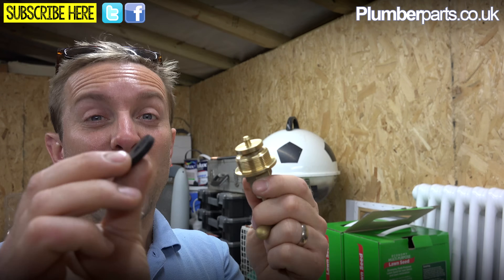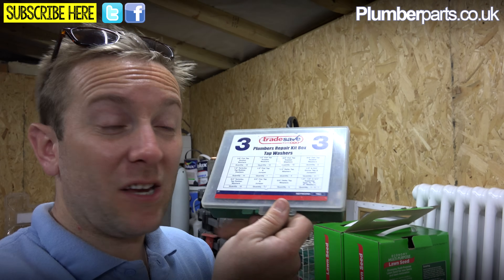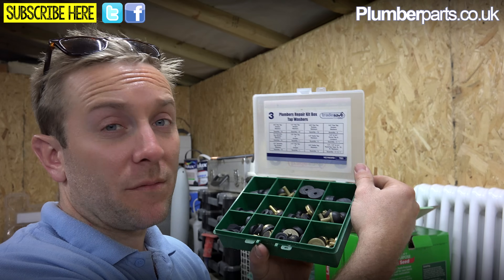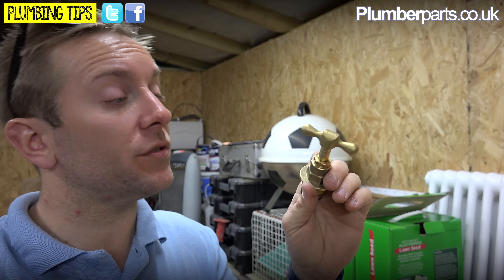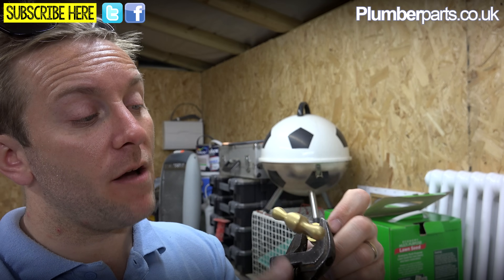The great thing about this part is that if it is the rubber washer, it's really really easy to change. You can just pop it off like so and pop a new rubber washer on. I've got a set of tap washers here - you can get these from all different plumbing supplies. There are loads of different types of tap washers. The last thing I want to quickly look at is that sometimes these cold water stop cocks get a little bit of a leak on them, and it's usually on this gland here - I get called out to this no end of times.